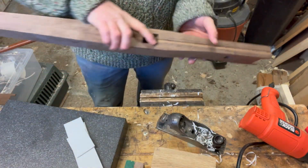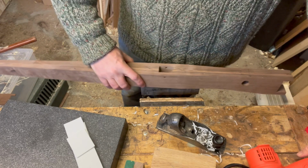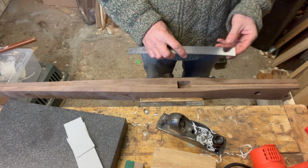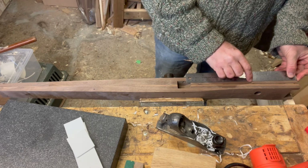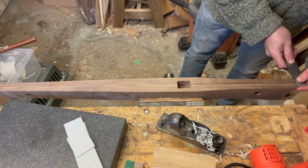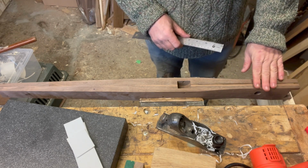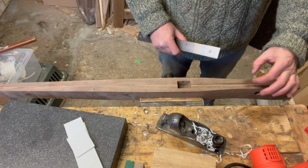So using the measurements that I put on the tiller to just lay out these inlays, that'll be our guide. So we're going to start with this front one, and we know that the whole thing is 12 centimeters long, and the widest part, which is most of it, is 26 millimeters, so 2.6 centimeters wide. So we'll start with that, and once we have that piece nice and square, we can measure in the end, where it sort of comes together and it sharpens at the end.